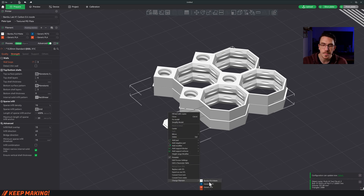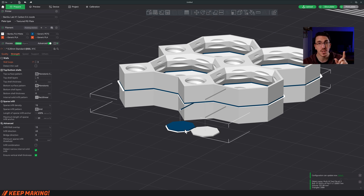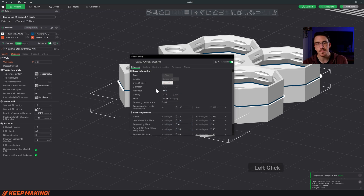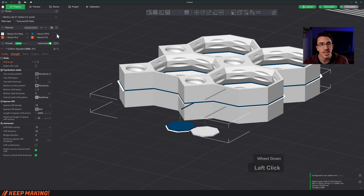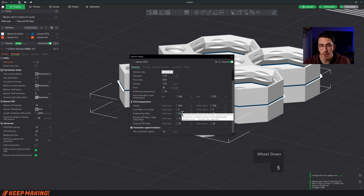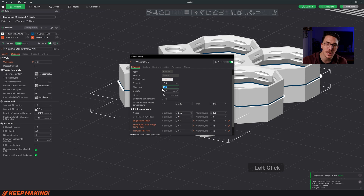Go to the interface layer and change that to PETG. Now here's the extra bit: these two objects have different bed temperatures, and we do not want that temperature change because it makes PLA prone to clogging when the temperature rises. Find the PLA bed temperature — mine is 55°C — then go to PETG and change all bed temperature fields to 55°C as well. Then change the flow rate for the PETG to 1.1.